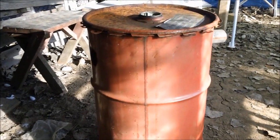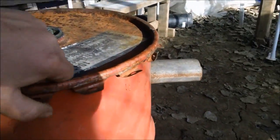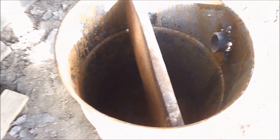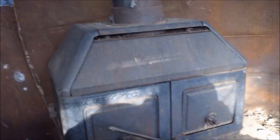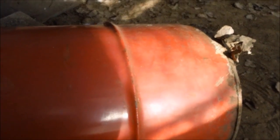This was originally built as a filtration system for a gasification unit. There's an inlet there and another one there, and I actually built a partition in the center which slides out. I'm going to cut that partition down a little bit, patch up both holes, and put an 8-inch inlet right here. The fire will concentrate on the divider, the smoke will divert around the back and front side, hit the plate, come back over, and exit through a 6-inch out the end. So 8-inch in and 6-inch out.